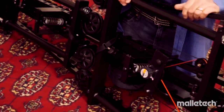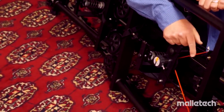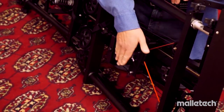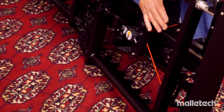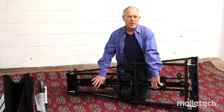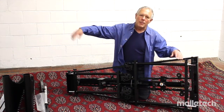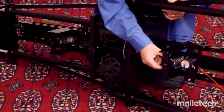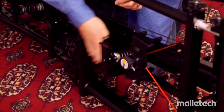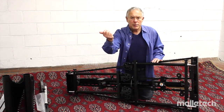This dial enables you to rotate the motor to change the tension on the timing drive belt. You probably won't use that, but if needed, loosen it and move the motor slightly to put more or less tension on the belt. These are the two spring towers. In our opinion at Malatec, you can't have a professional vibe with one spring tower — with one spring in the middle, the damper bar floats unevenly. So we have two spring towers, with a knob to adjust tension on each.